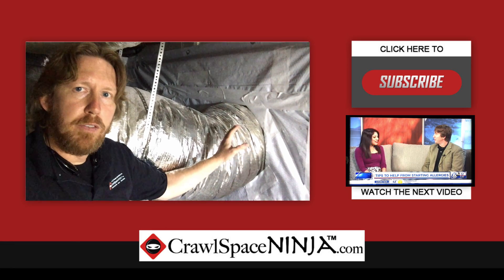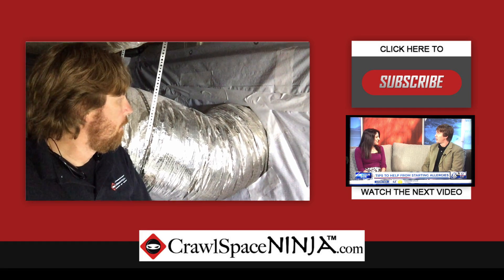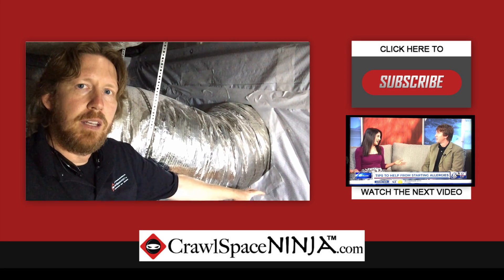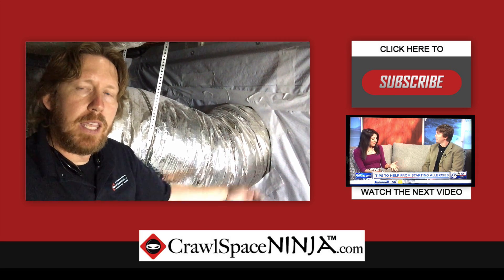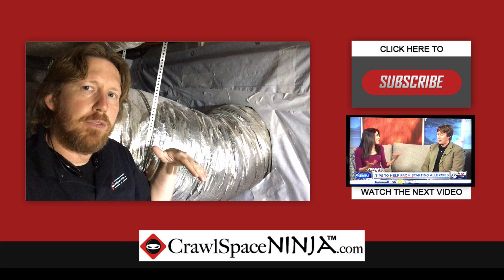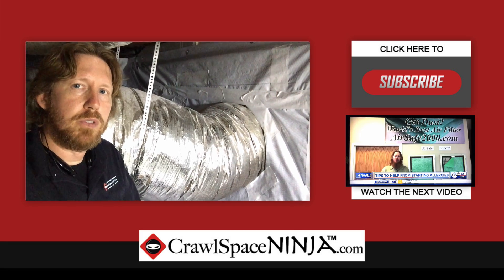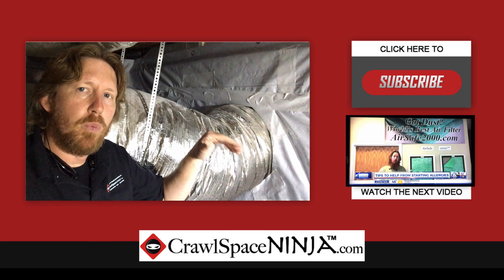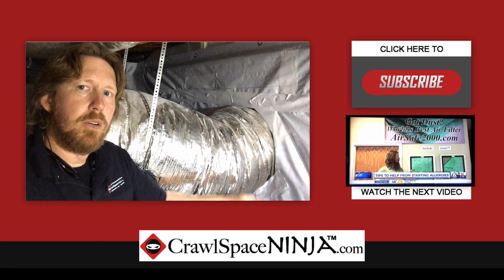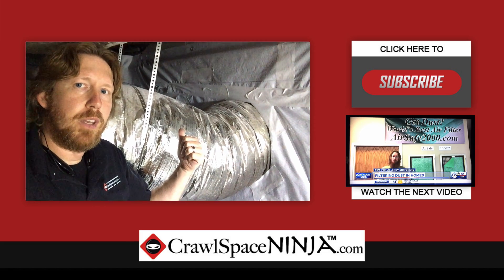One of the first places I would look if you're having problems with animals getting into your crawl space is right here. We sealed this air duct from the inside as well as did everything we can on the outside. But even if they're sealed properly on the outside, they still allow for small rodents and even some decent-sized possums and raccoons to get underneath the HVAC system. Once they get underneath that outdoor unit, they have a freeway right into your crawl space. So if you want to try to stop critters from getting in your crawl space, this is a great way to do it.